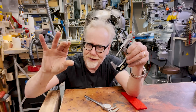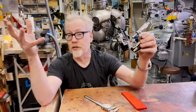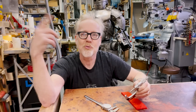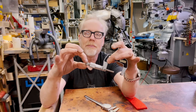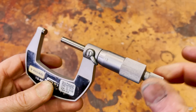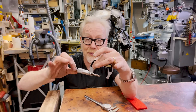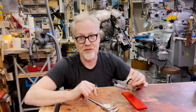If you grab a piece of plastic and torque down on this, you'll be able to actually compress that plastic. How do you know? The same could be true for a soft metal, or a dimensional thing you're making that you don't realize compresses. How do you know that you're getting the same measurement every single time? The ratchet in here helps do that because you're not applying more force to the barrel — you're applying the same amount of force to get that ratchet every single time. And as long as that ratchet happens, you know you're getting a comparable measurement each time.